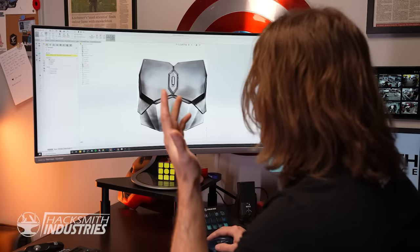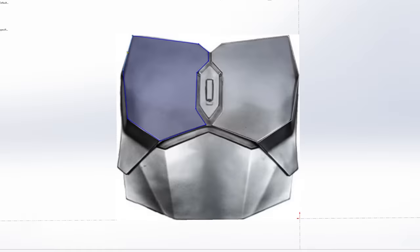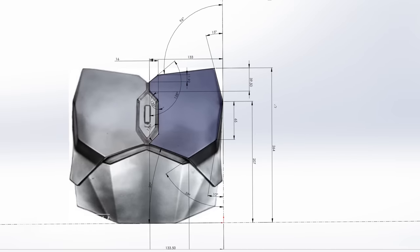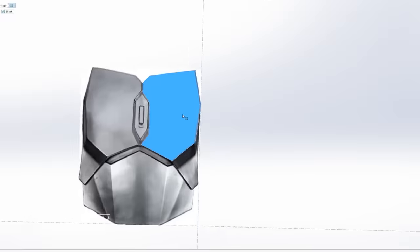It's literally click-and-drag. Put a line there, and boom — there's the rough shape of one of the breastplates. It's important to dimension your sketch. In SolidWorks, you can tell if it's not dimensioned if the lines are blue; you want them to be black. I've already fully dimensioned the other sketch, so now all the lines are black, which means if you try to click-and-drag, nothing will move around. Now we can just make an extrude boss and turn it into a sheet metal part.